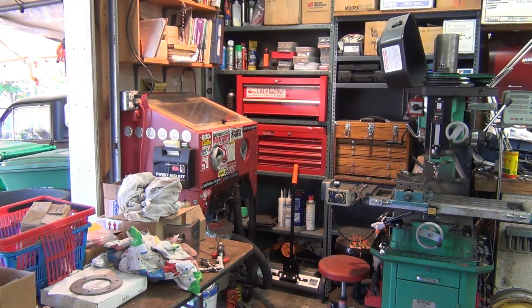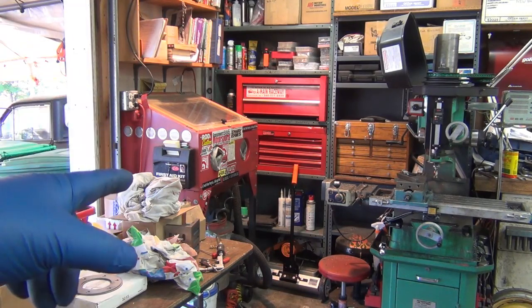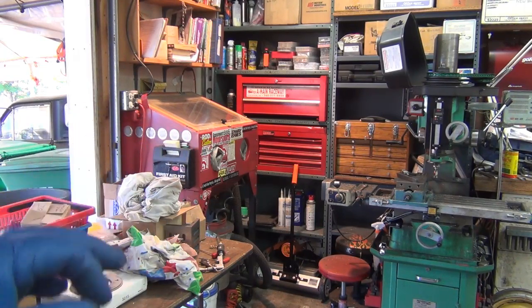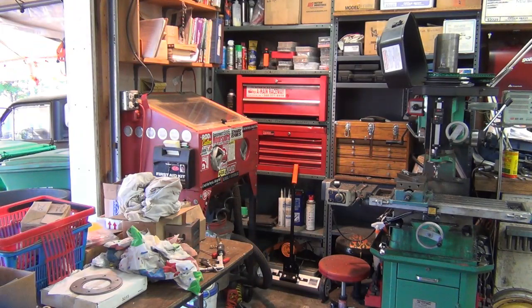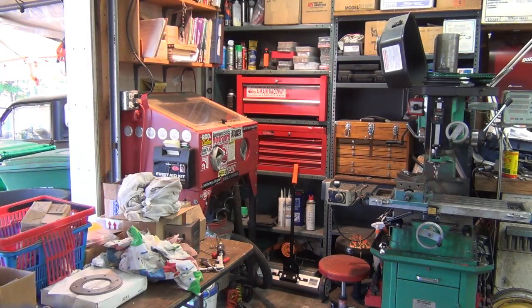Anyway, okay, so this glass bead cabinet, I've had this sandblast cabinet here for years, tucked in the corner here. I have glass beads in it, have for a long time. I love the finish on glass beads. Now, technically, glass beads should be run at about 45 psi, so that the beads bounce on, grab a little chunk of something, polish, smooth, or whatever, and bounce back off. I'm running it more like at 80 or 90, so my glass beads hit, crush, break. And all those little sharp edges then clean stuff.